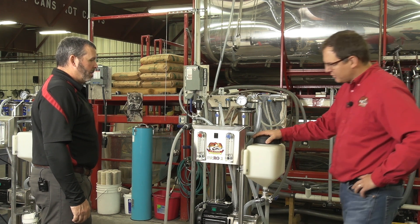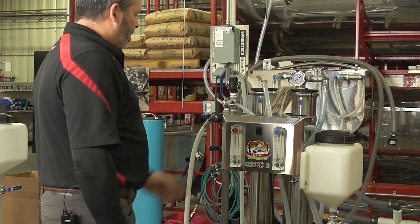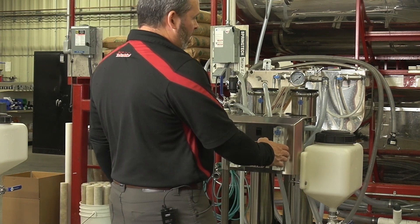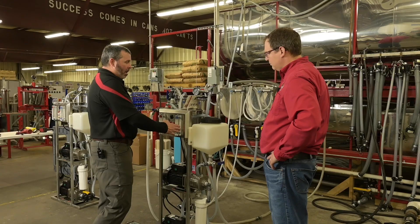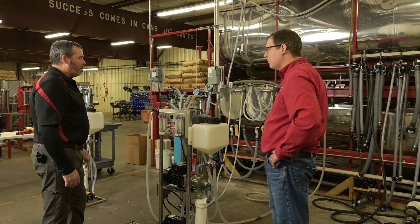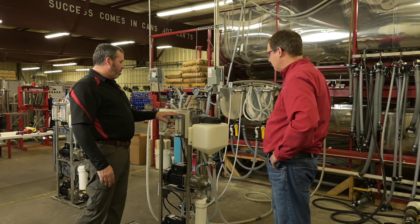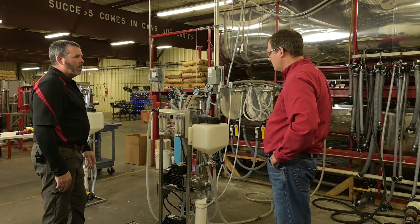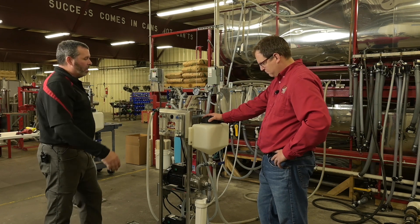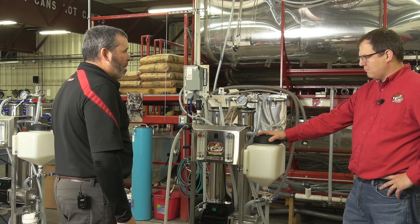How about the front parts of this machine and what these are doing here? This is your concentrate meter and this is your permeate meter. This tells you your outgoing gallons per minute of your concentrate, and this also tells you your outgoing gallons per minute of your permeate. Each machine in our lineup has its own flow meter — each one has a concentrate meter and each one has a permeate meter. The bigger machines have one individual meter for each membrane, while this one includes both membranes.